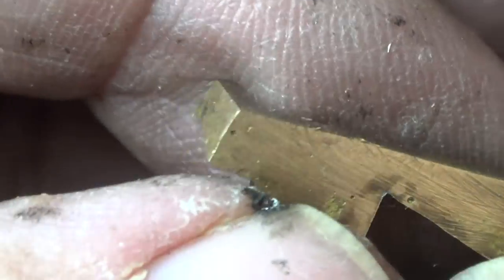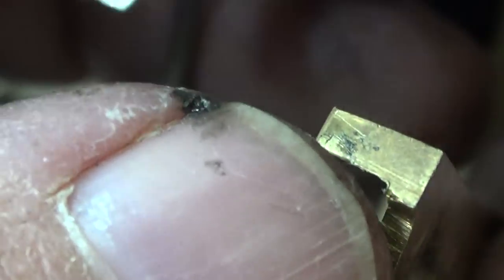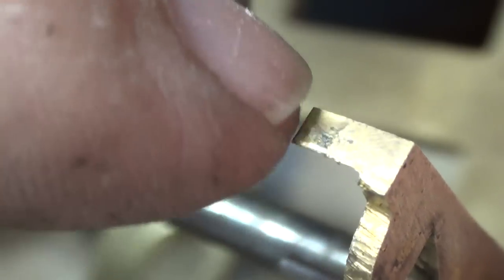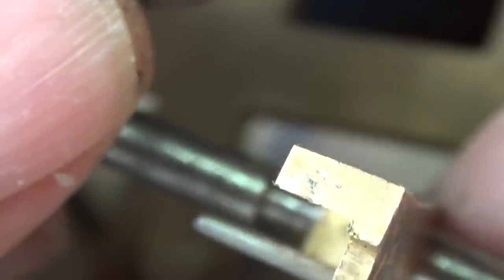This particular lever, part of the lever, has a detente on it. And this is what stops the pin on the warning wheel to stop it from striking. After this lever drops down into a slot on a count wheel, it allows this to drop in front of the pin on the warning wheel, the warning pin, and stops the strike. It seems to be okay.